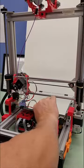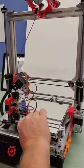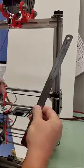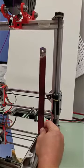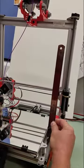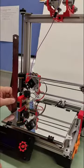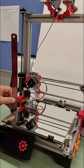I'm going to move the bed plate nice and slow — I don't want to move it fast. I'm going to move it out and check the measurement from the frame. Using a millimeter rule, I'm going to go from the top of the Y plate to the top of the bed plate — not the mirror glass — and measure 28 millimeters. Then I'll come over to the other side and measure from the top of the Y plate to the top of the bed plate, and it will also be 28 millimeters.